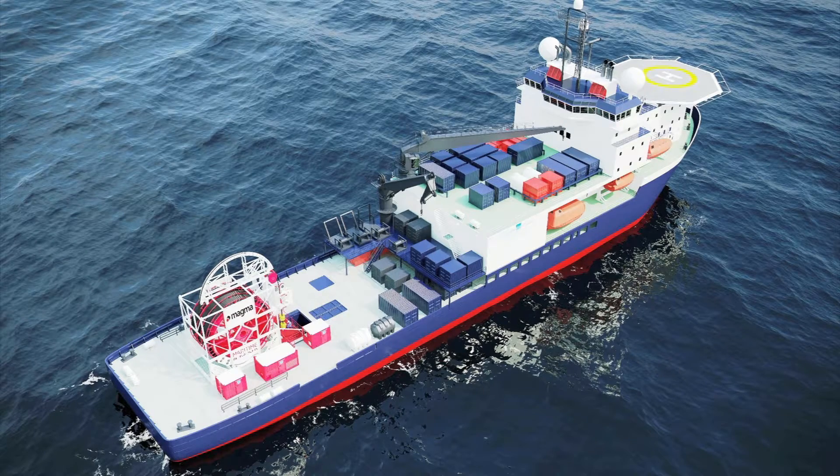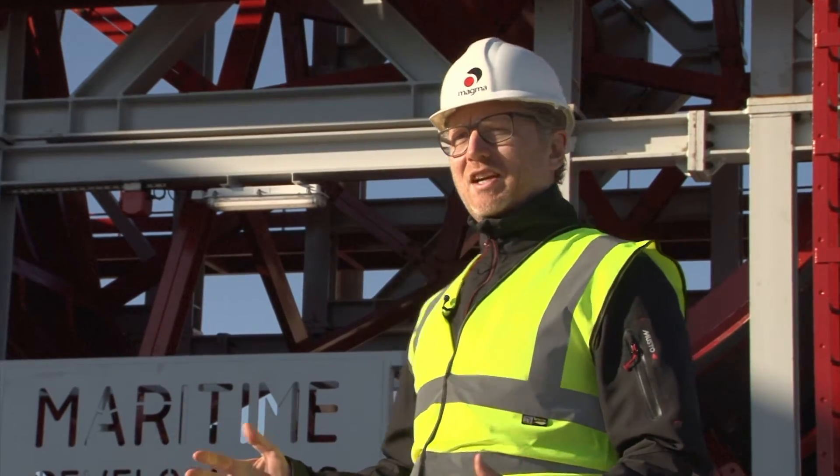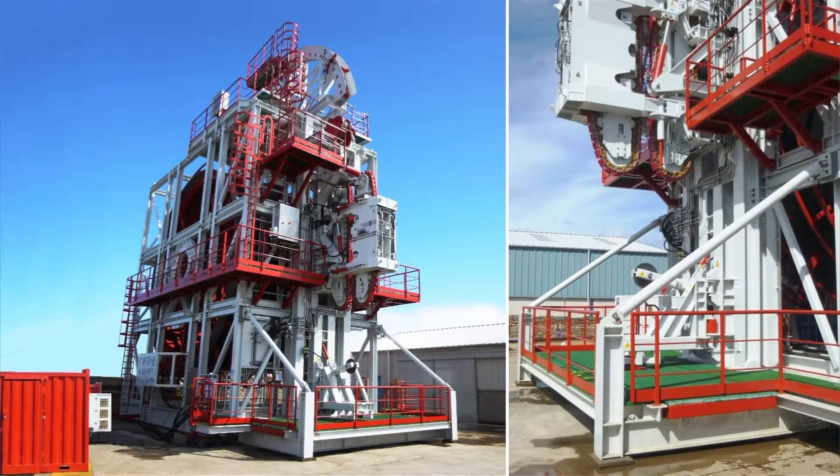The IDP in its single unit can therefore easily be positioned over a moon pool or off the edge of the vessel. To give you some idea of the specification, the system you can see here is about 11 metres frame length, 6 metres in depth, then about a 3.5 metre overhang of the platform at the front and about 17 metres in height to the top of the chute. It weighs all up with three pipes about 175 tonnes.